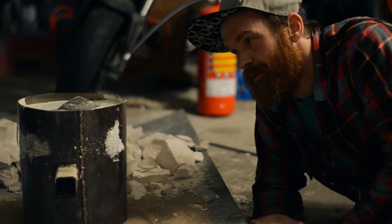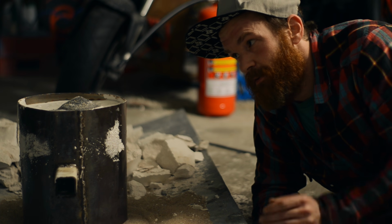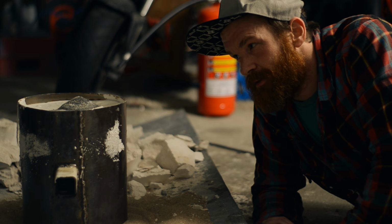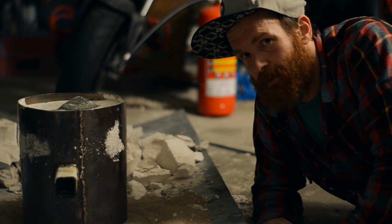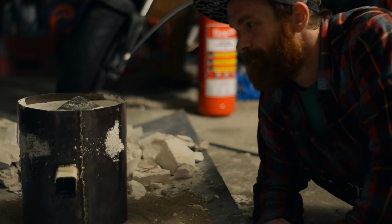Also, you probably saw that my pouring basin was too shallow and it started overflowing into the riser. So there were two streams colliding down there. Might have caused some porosity or turbulence issues, but might not. Exciting.